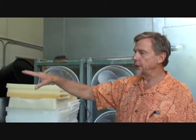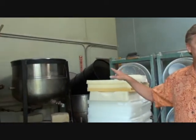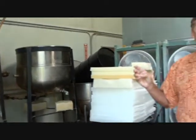Then these different ingredients are brought together in a mixing pot, and that's the beginning of the process. So for each formula, there are different percentages of the different ingredients. If you're doing a warm water or tropical wax, you have a higher melt temperature paraffin. If you're doing a cold water wax, you're dropping your melt temperature so that it's softer and applies easier in cold weather.